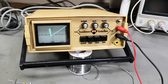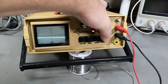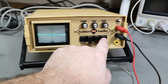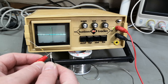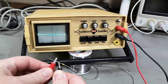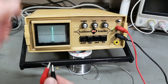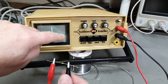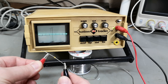If I short it, zero is now in the middle. So why don't I see that? That is because I'm in low. Let's go to medium. Oops - so there is a resistor broken, because it's supposed to be a flat line. Right now it's only voltage and only current. Okay, now it works - medium works. And then, perfect! Now we see the voltage and the breakdown. I'll zero that and have it exactly in the middle, so now I know where zero volts is. See - this is the forward of a zener diode and this is the reverse part.